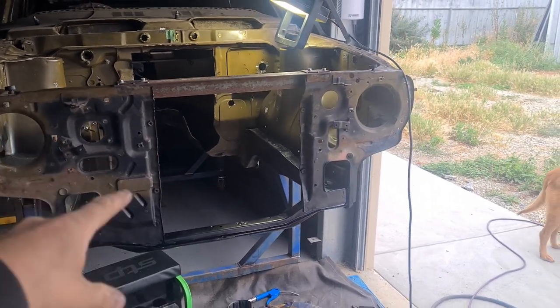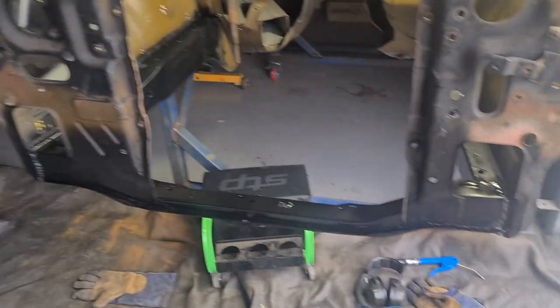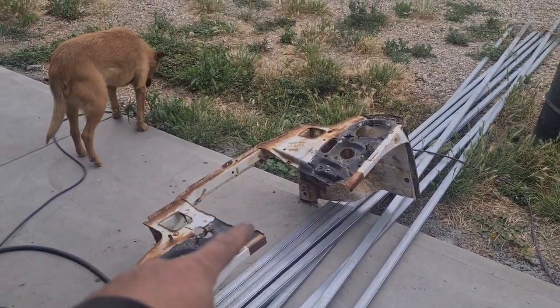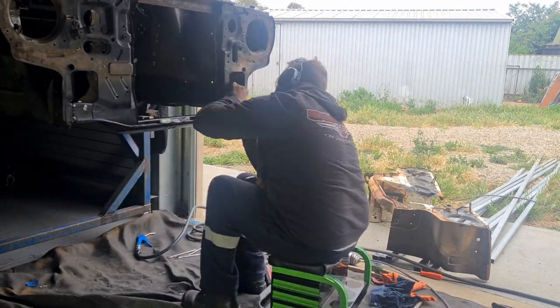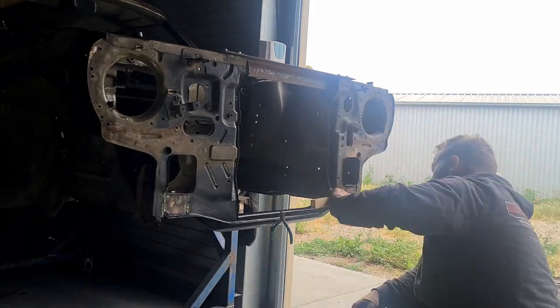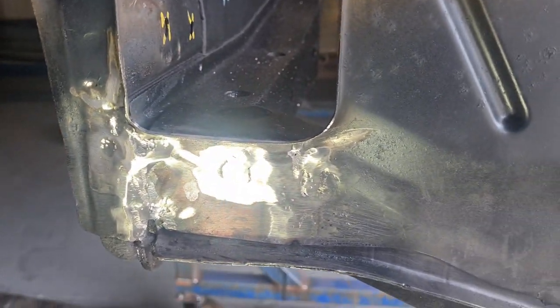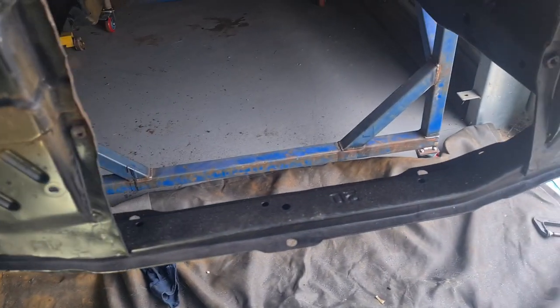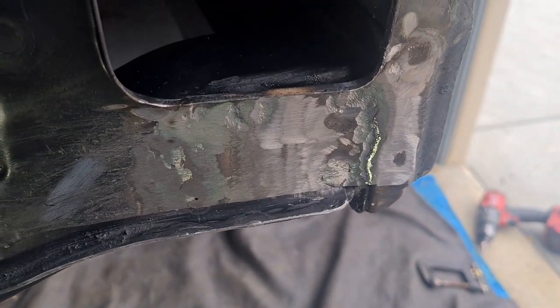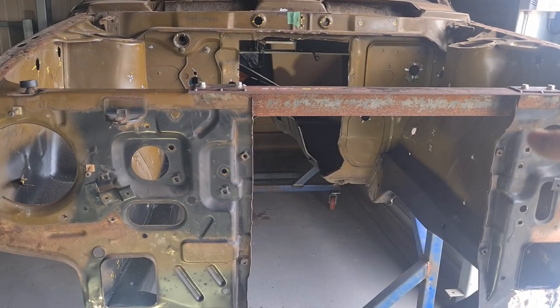The last episode on the K25 I finished about 10 minutes ago and that paint's still drying. I did notice when I was filming the outro that I didn't make these panels, which I completely forgot about. So I need to make one of those on either side, but I'm going to cheat and cut up this front end and weld that in. They're not the greatest, but you can see what I was going for — just trying to blend in this corner and this corner. I did blow a couple of holes in one corner, so I'm a little annoyed about that. But it looks good enough and you'll never see it once the bumper's in. So I'm just going to paint these black and might do some shaving of the engine bay stuff off camera. Then later today I'm going to try and get the engine in there and see where we can get it to sit.